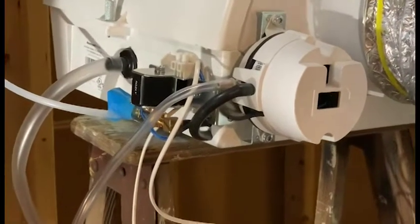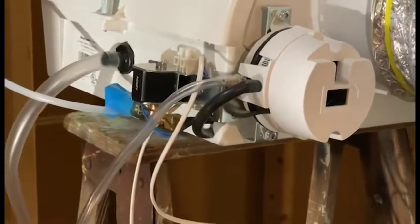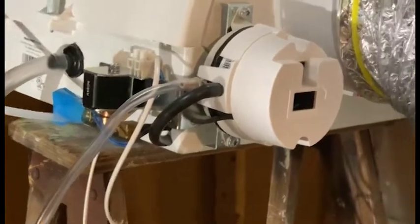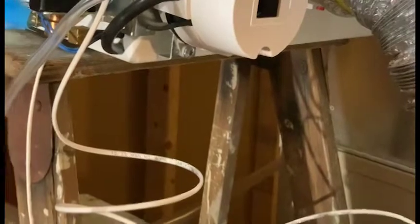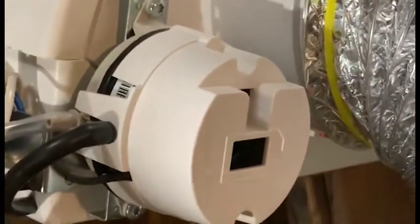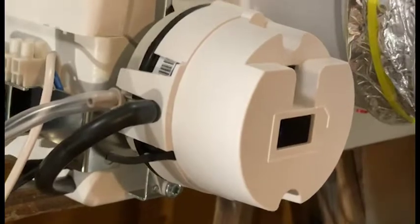The final procedure is to connect an air tube from this pressure switch that will run to the return air duct and will be fitted in so that it will produce airflow for the pressure switch to sense and then turn on the unit.